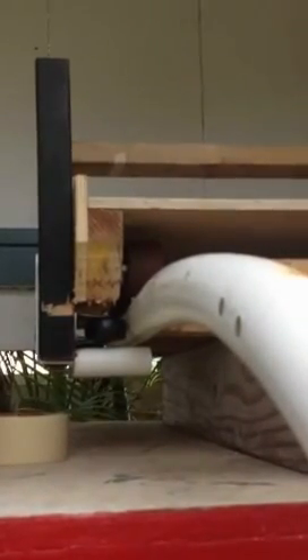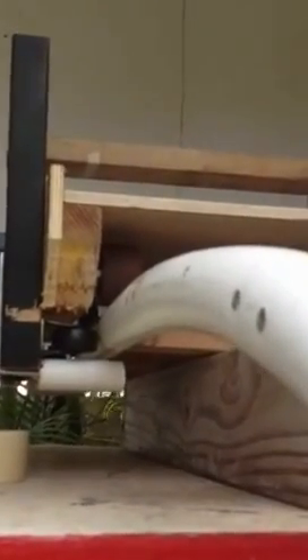Up here we get a view of the cart. The cart is sort of temporary at this point — I have designs on welding a good one, but we're just trying to figure it out now. It's got skate wheels on the top with good bearings, so they're pretty smooth. The side is just casters, because they don't get any weight on them. And then the bottom, I just epoxied some one-inch PVC to it, just as a fail-safe so it doesn't fall off. It's only making one right-hand turn, so it doesn't need them on the other side, only on this side.